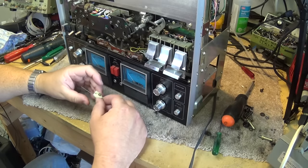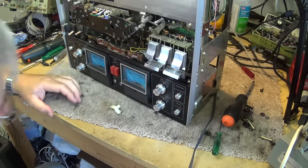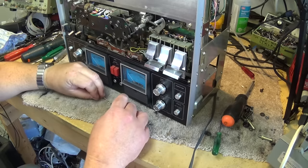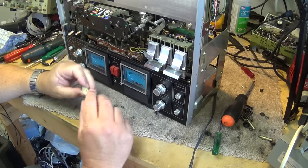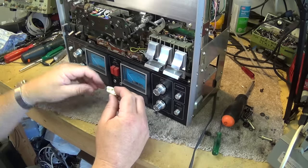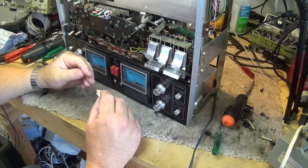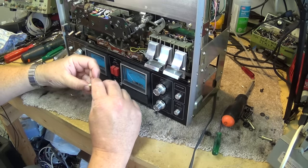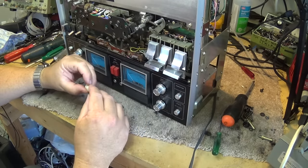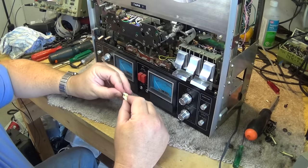That's okay, because I'm going to put some JB Weld on here to hold this arm in place so that this arm doesn't fall out again. I'm going to mix up some epoxy — we'll clean this up first, because epoxy doesn't like to stick where there's grease. We'll mix up some epoxy and glue that arm back on. And here's why it's always a good idea to work things through before you commit to putting things in place with epoxy.